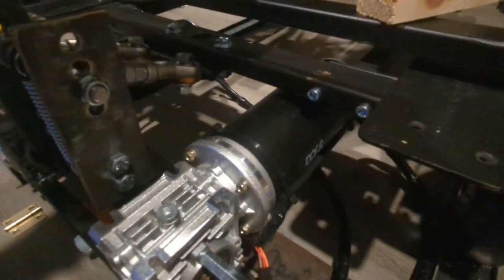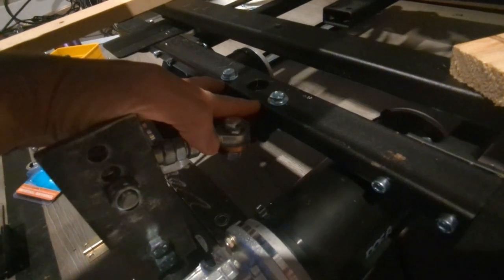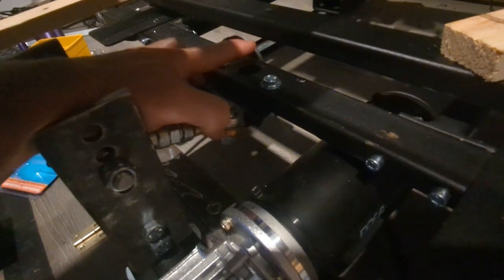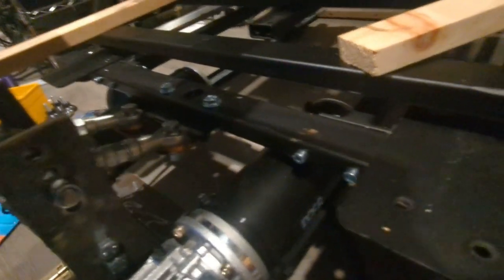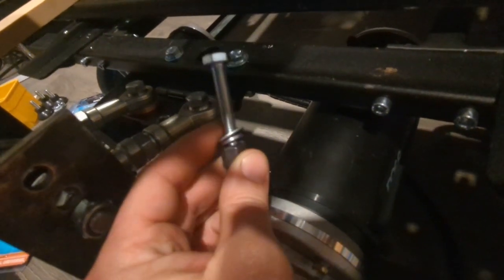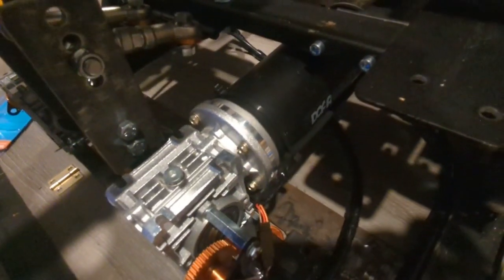And then somebody on the Facebook DOF Reality forums pointed out to me that even though this hinge here is bolted solid to the frame, all of the torque is coming up through this pivot bolt for the yaw, which is only a relatively small bolt. So it's possible that that could shear off, and then the whole rig would basically fall off the platform, so that's no good.